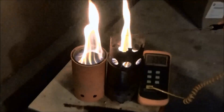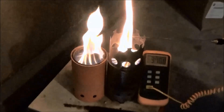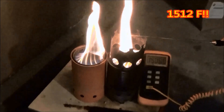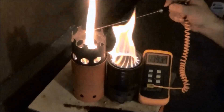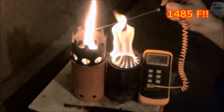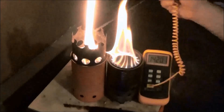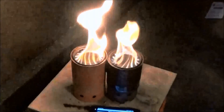At this point I decided to do a temperature test. After putting on the pot stand the flame stabilized very nicely and quickly went up to 1,512 degrees Fahrenheit, which is a pretty good heat range. After putting it on the Vortex 5.4 I was able to get up to about 1,485 degrees Fahrenheit, which is slightly less than I have measured on that Vortex stove in the past — I generally can get it over 1,500 degrees.